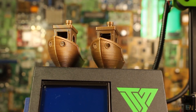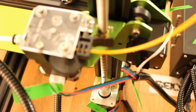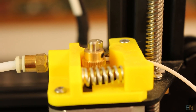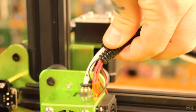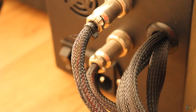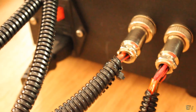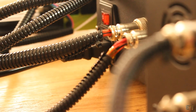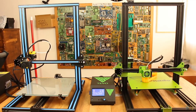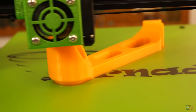The print quality is as good as the Creality. We still have V-shaped rollers with eccentric nuts for all axes, and only one lead screw for the Z-axis on the back, just like the first model of the Creality. One thing I don't like is the wire plastic cover — it's cheap and the wires look fragile. The Creality has a better textile material cover that goes inside the plug, whereas the Tornado's plastic cover won't go inside, leaving the fragile part exposed. That's a minus for the Tornado. But in general it's a very good printer — in my opinion quite better than the first model of the Creality I have, which makes sense since it's the same design with improvements.